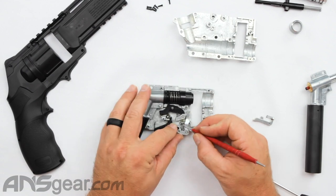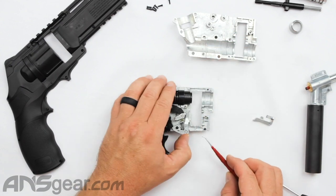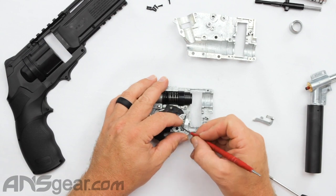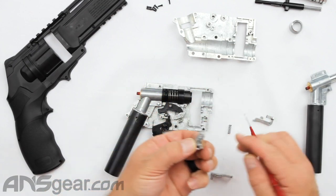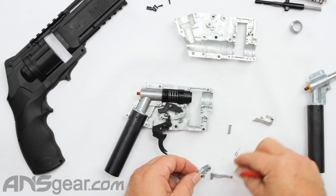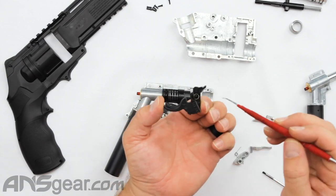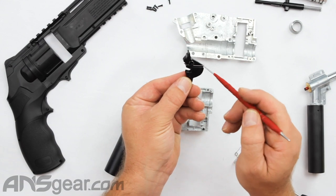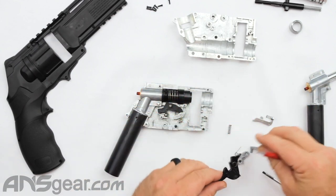Next, we're going to pull out this one right here. There's a spring that runs along this part right there which pushes this part down, but there's also a spring on the backside which causes this arm to go this way. We're going to take this spring out, set it over here, and take this arm out. You can see this spring right here — it's a very thin, tiny little spring that sits inside of there. Next, we've got our trigger, and our trigger has a very large spring on the backside of it. The short end of the spring faces the front of the trigger; the long end of the spring faces the back of the trigger.